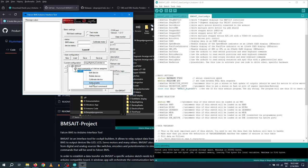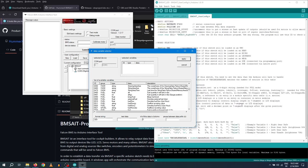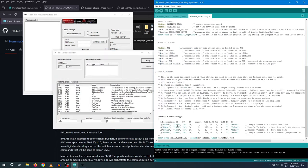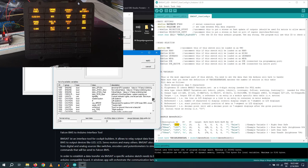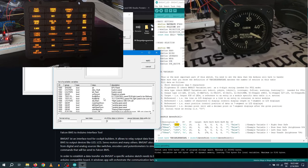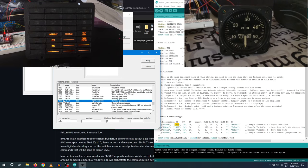The concept is straightforward. You just tell the program which variables and data get sent to which Arduino. In the Arduino code, you just take this data, work with it, modify it as you like, and then use it to control your hardware. You can turn LEDs on or off, set a stepper motor to a specific position for a needle, or show some specific text on a display.